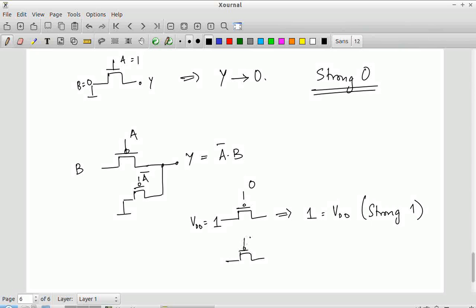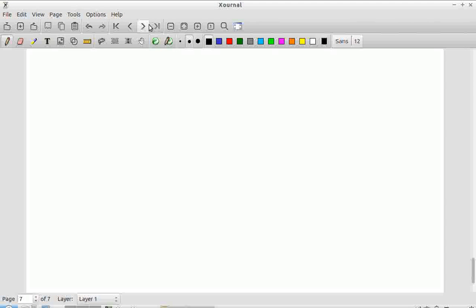But if I have this circuit, right, and let's say that the output was initially at VDD, it starts draining out, the voltage at the output drops up to VT. So it becomes a weak zero. Beyond this point, the VGS or VSG of the PMOS is no longer high enough to sustain a channel, no current will flow, and the voltage will get stuck at VT. Okay? So PMOS transistors have the problem of a weak zero and a strong one. Well, strong one is not a problem, strong one is a good thing to have. NMOS transistors have a strong zero and a weak one.